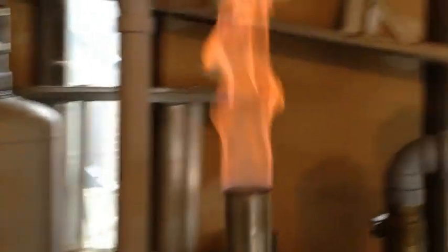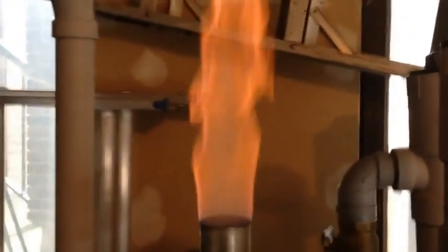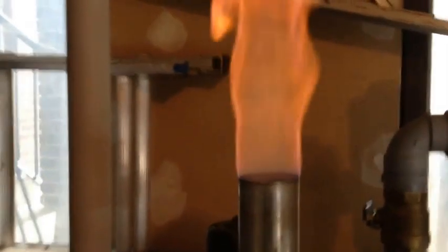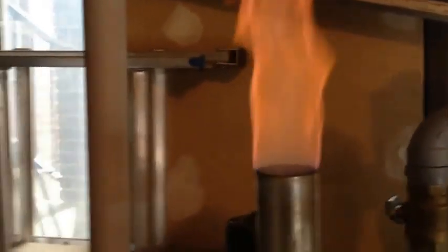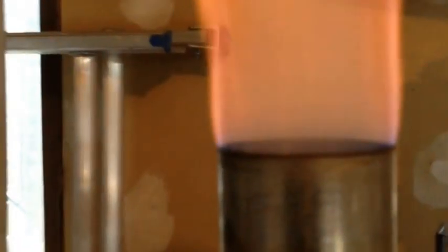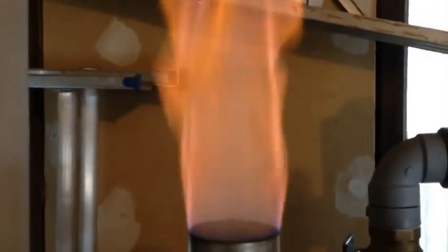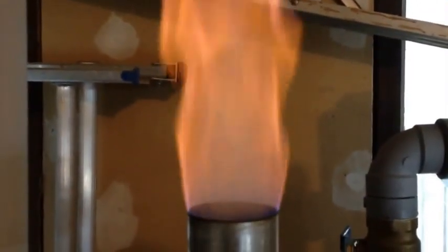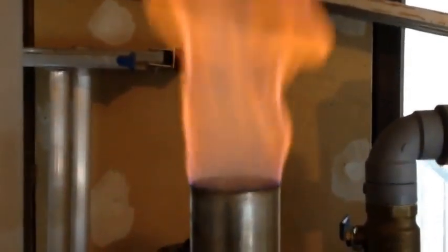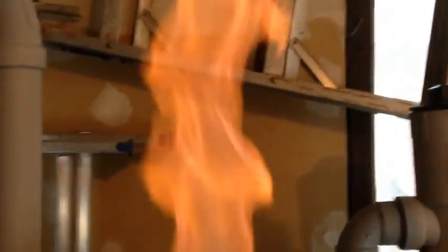It's been about a couple of minutes now. I shook the grate and now you can tell it's a beautiful nice Halloween orange flame - it's doing its job. As you look up here, the flame is constant - you don't have those little ripples anymore. So it's just one thing I've learned: as soon as this flame gets kind of pink - too much pink and the flame starts to dissipate - you either got a bridging issue, a clog, or something's wrong.